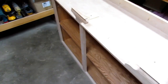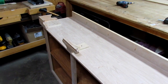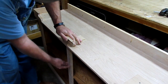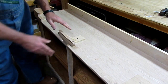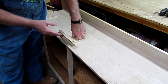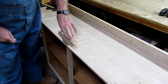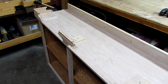And then I cut out a center one. That's not something you normally see on something with the feet on it like that. You see them on each corner. But there again, we got the post on front and back. It's going to help hold the weight. So I come up with a design for a foot right here that let it sit directly over it, and it would hold the weight in the middle of the cabinet. And the whole assembly is glued and screwed together.